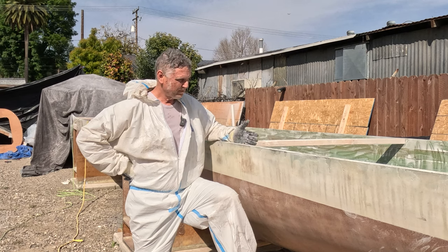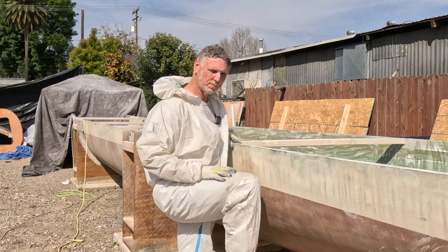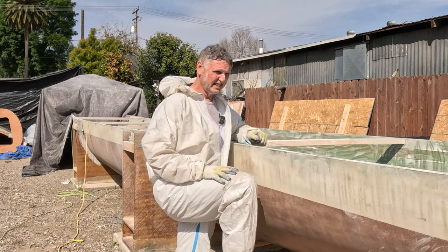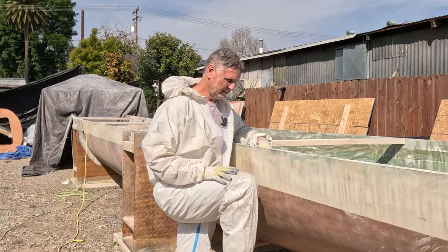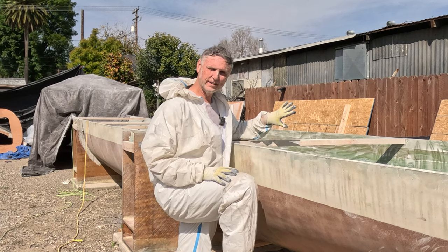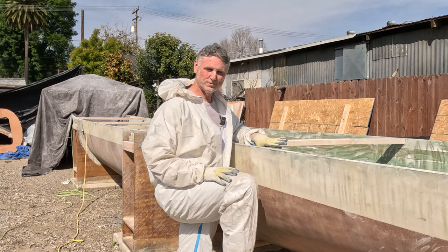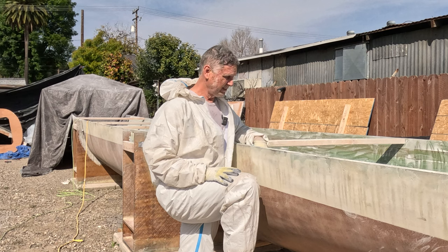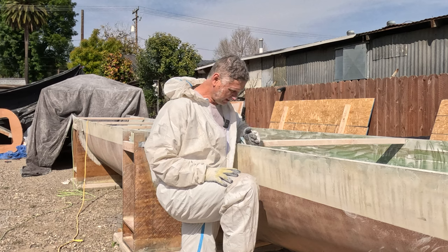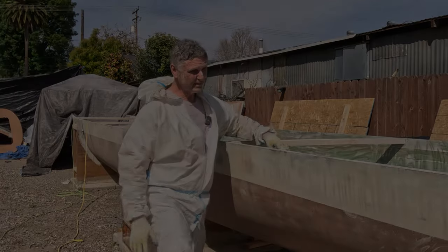So now we won't have to fair the inside of this, because not like the outside of the hull, we're trying to get this perfect finish on it. On the inside, once we glass it, we're gonna be putting peel ply down to give it a nice surface. And then when we're ready, we'll pull the peel ply and we'll use a bilge paint to paint this rather than fairing it. So this is not weeks of fairing work to go here. This is just really fill in some epoxy and get our layer of fiberglass on with peel ply, and then it'll be much later that we do the bilge paint.